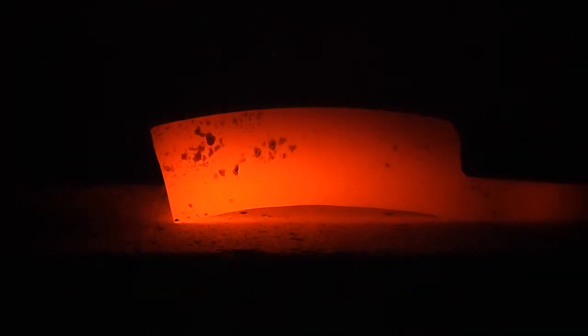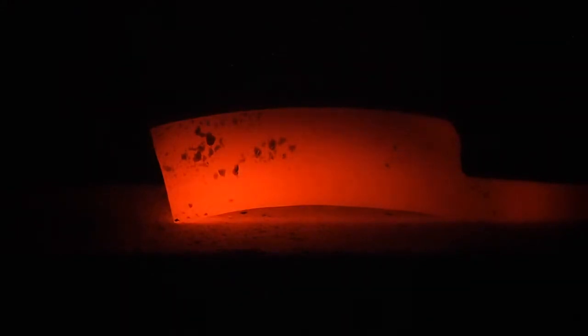As you can see on the heel of the razor, it's starting to cool off, and as it cools off the crystalline structure changes and releases heat, so it gets hot again. You can see the shadow where it's cooling, and then after it cools a little bit the crystalline structure changes and it heats up again and turns it orange again.